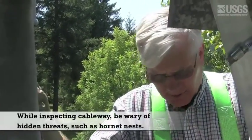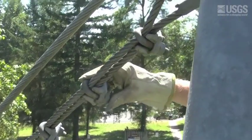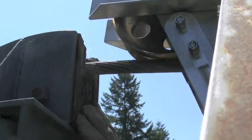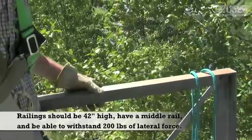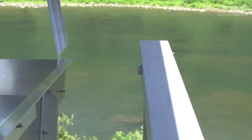We're at the top of the A-frame continuing with the pre-use inspection. The backstay line has four cable clips, properly installed, and they appear tight. The head block is an old wood head block — it's going to need to be replaced sometime, but it looks okay yet. Also physically check the railing — this one is very solid, just to make sure that if we do have to lean up against it, it's going to hold us. The A-frame looks good.